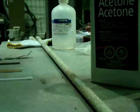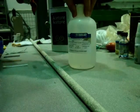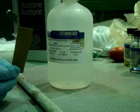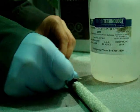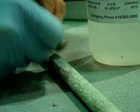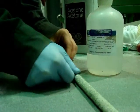Nothing should remain on the surface because it might leave a film that can make the strain gauge come apart from the surface. After that, we do a preliminary dry abrading with 220 or 320 grit silicon carbide abrading paper. This is a 220 abrading paper — we do the abrading completely, in a dry situation. After that we do the second one, which is 320, almost finer than the first one.